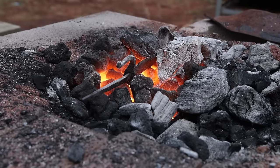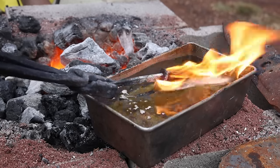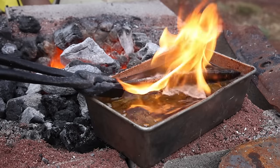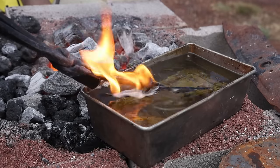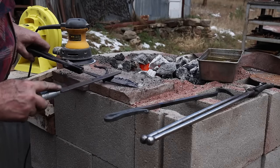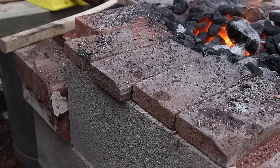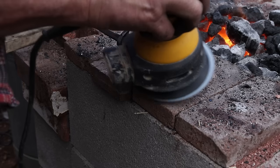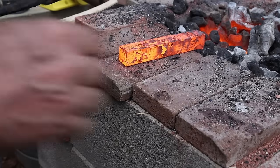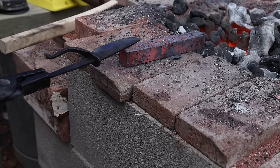After the three normalizing cycles I'll bring this back up again and quench it. I'm mostly interested in quenching the edge — I don't think the spine and the tang really need it, although it's hard to avoid quenching some of that. Testing it with a file tells you whether it got hard or not. It does seem to be good and hard, so we're ready to go ahead and temper. I'm going to clean it up with a palm sander so I can watch the tempering colors run, and then use a piece of steel that's been heating in the forge as a heat source for tempering. This actually went a little bit fast and I got a little bit on the blue side — not ideal, but it isn't really going to hurt much in the long run.